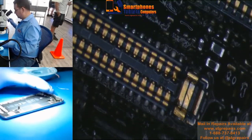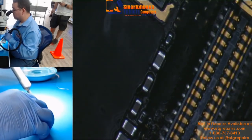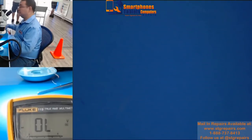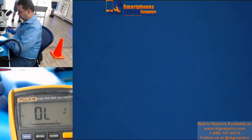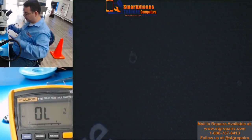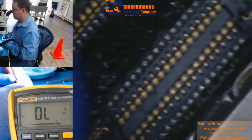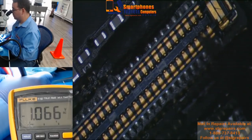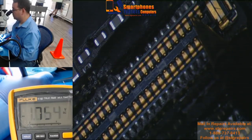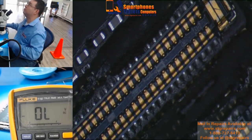After soldering, if we want, we can add a coating. Let's test now — we're going to test pin number three to see if we have any new results or if the line is clear. We have 502 and we're supposed to have 506, so this means we are okay. There's no short to ground, so by now we're supposed to have an image.